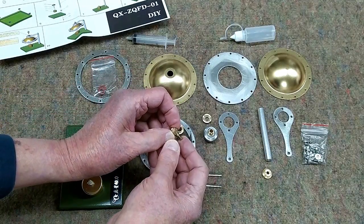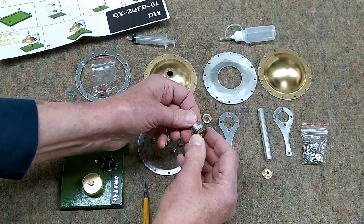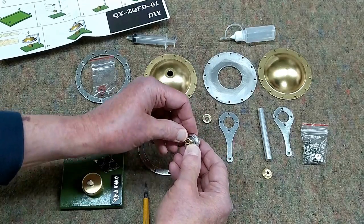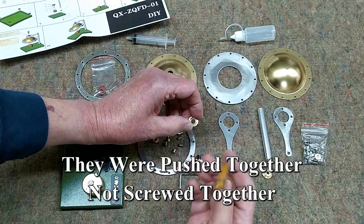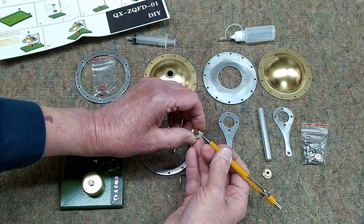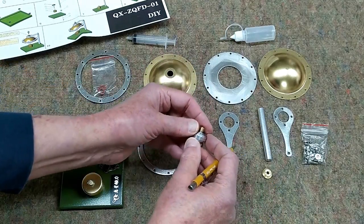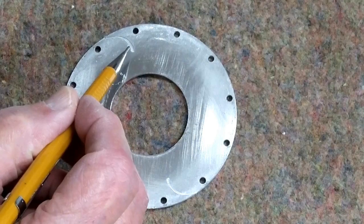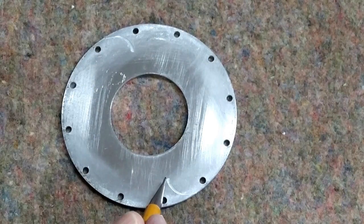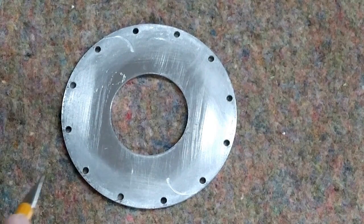We should note that this one has a safety relief valve, so hopefully that won't blow up on you. Now this bearing and this piece of brass nut come together with this piece screwed onto it, and there's a rather delicate little silicone o-ring in here, so you do not want to lose track of that. That seals on this piece of brass. You can see these flow paths that have been machined in there — another reason to only use distilled water, so you don't gain mineral deposits that might plug up this very fine opening.